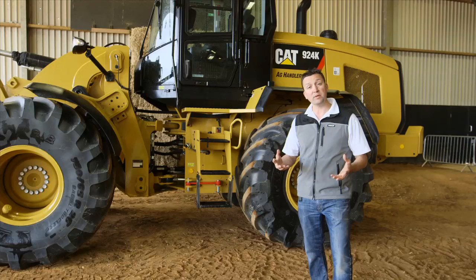In addition to helping with fuel burn, we're also going to bring to you an industry first in a fuel efficient reverse feature. The way it works, you can customize your forward speed for climbing the pit in range 1, tuned for silage work, from 1 kph all the way to 13 kph. Maybe we set it at 6 or 7 or 8. When you flick it into reverse, however, it's going to come back down the pit at a full 13 kilometers per hour, or you can just come down at a lower RPM, saving you additional fuel.